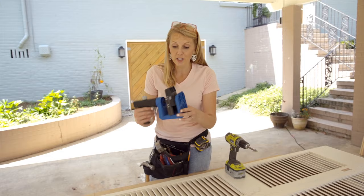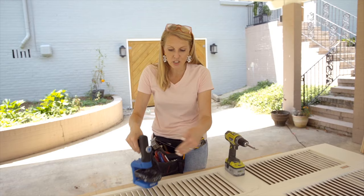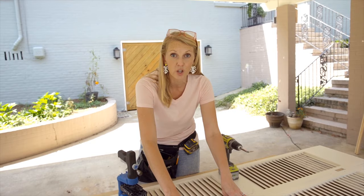All the old hardware is removed and I'm ready to drill pocket holes with my jig — there's a little sawdust left over from my last project. I'm going to drill pocket holes on just one side of the door, tighten them together with some long screws, patch the holes, and then you'll never know they were ever two separate doors.